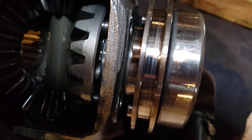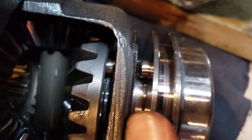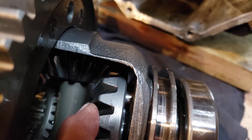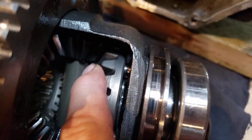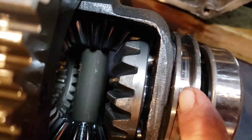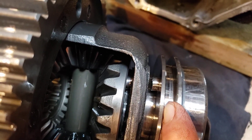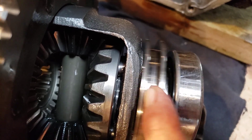Of course this is operator error — you can tell the sarcasm in my voice. This collar with the long pins, which are supposed to go all the way through and into that gear — look at the gap here, look at how thin this is. These things are breaking because it's crap. How much movement is in there after they broke? This collar barely moves back and forth. The leverage is ridiculous. This is the second repair in 2500 hours. Maybe we need eight pins, not just four, to make this thing work right.